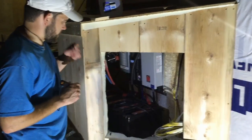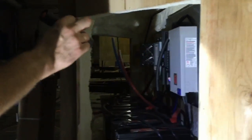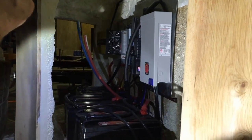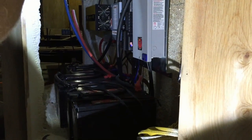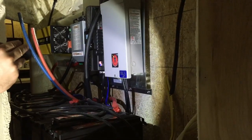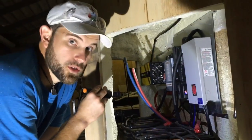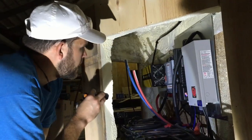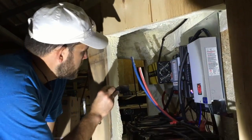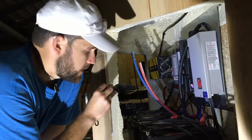Here is the finish of the install. Thanks to the guys at Incredible Tiny Homes — Randy and his guys do a great job building these boxes. They give us plenty enough space that not only can we fit a normal four-battery bank in there for simple uses, but this customer, since it's going to a winter climate, is going to have extra batteries in there so they can run a heater unit. This is the OTG 2.0 that we've moved up to — it's not so much about being fancy as it is that it saves customers money and gives us more opportunity to put more solar inputs in. We're actually going to be going to OTG 3.0 very soon — I've found another design that's going to save more money and create more slots. The Power Max unit over there gives 30 amp output, so we also have charging capability for shore power to charge this battery bank up.